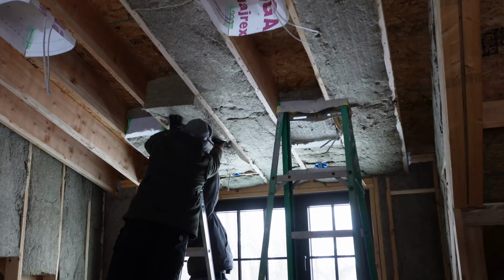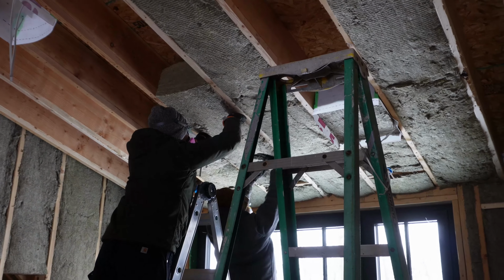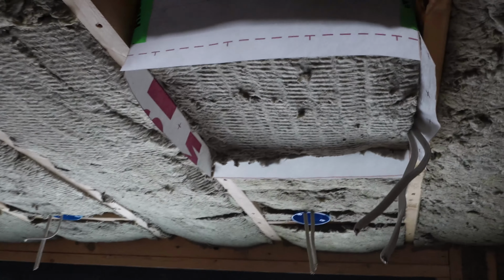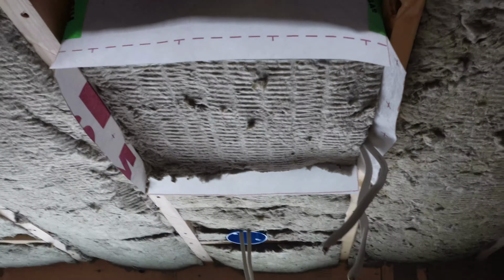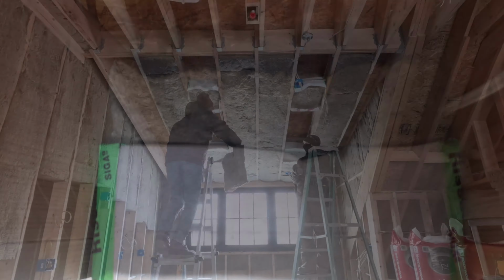Look at these professional insulators. Getting some R38 up. Elena's got a sweat going on. This is looking really clean, and the Siga boxes are working as designed. We made them 5.5 inches deep so we could put a standard piece of R23 in there, cut at 14.5 inches. So that fits in there nice and snug. And then on top, we can still fit a 3.5 inch bat.